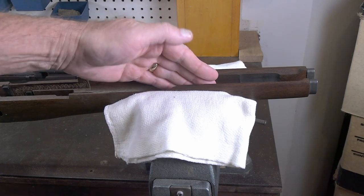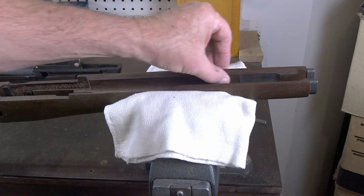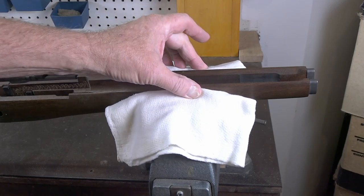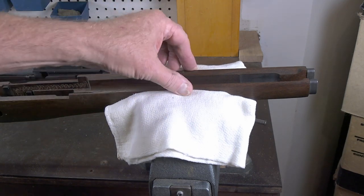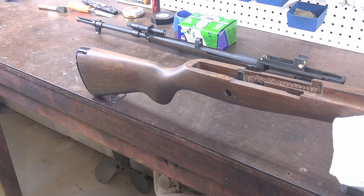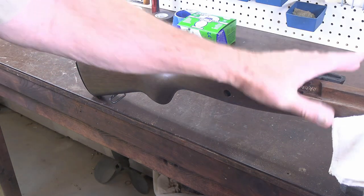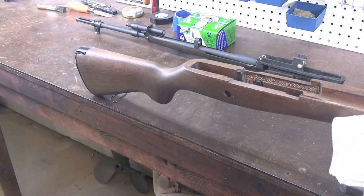I don't want to crush this. This is very fragile here, because there's no support. This is a relatively thin walnut. So just position your vise jaws and give them a gentle squeeze without turning this wood inward. And at the back side, you can see it's resting down on the bench. I've got an absolutely firm support that can't go anywhere while I'm working. I don't want to have any surprises where that suddenly drops down.